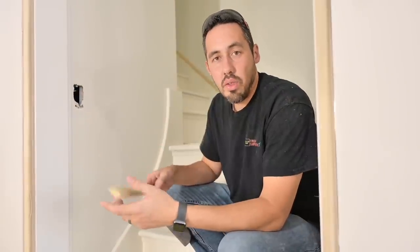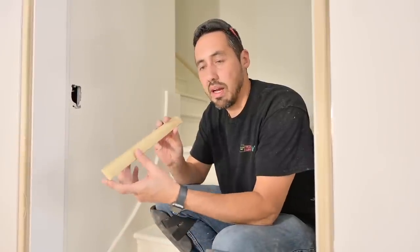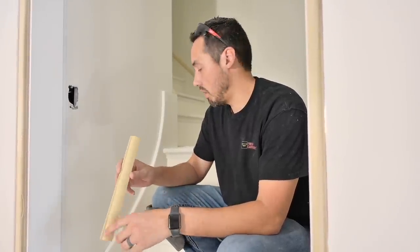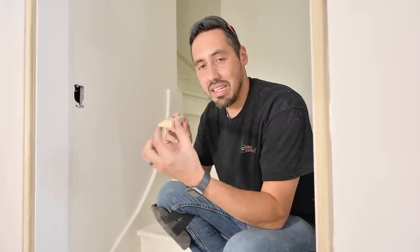There are other ways you could accomplish this task. You could do a steam box — buy a steamer, build a box to put the pieces of molding in, and the steam saturates the wood fibers with moisture, which softens them so you can bend them into any shape. They use this on curved millwork and in boat building. It's a pretty common method. However, there are several ways to do things, so we're going with bent lamination. This is actually my first time doing this.